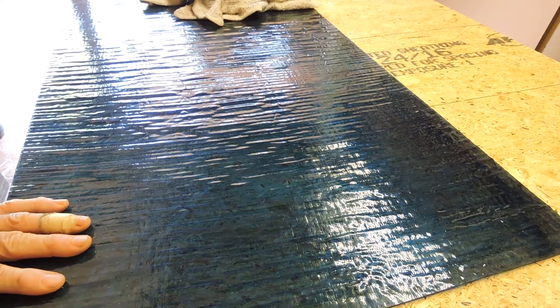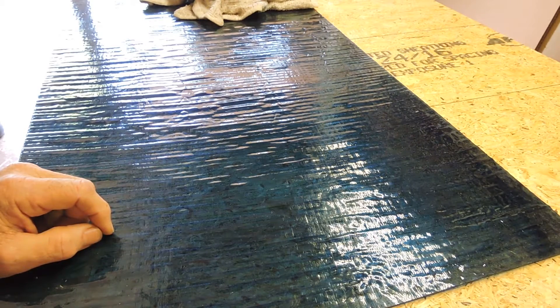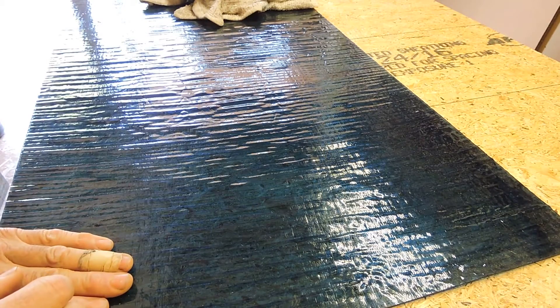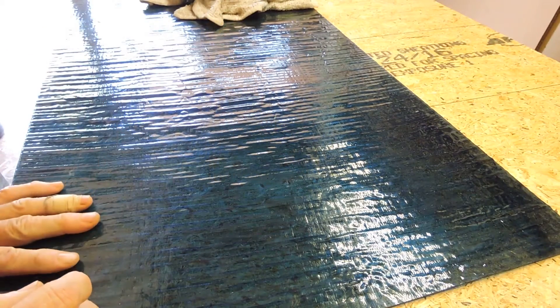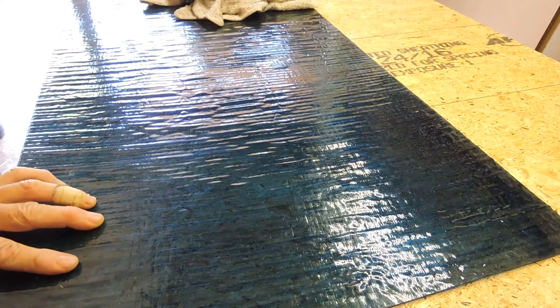We're going to talk about why it's important to discuss cutting this glass. A lot of people already know this, but some don't. I've seen some blogs and posts where people literally wash their glass — I'm fascinated by that. They're washing the glass because there's a residue on it, often not always. Some companies more than others, especially on clear textures and architectural clears — it's kind of like a fine talcum powder, almost like mini cornmeal. It keeps the glass from sliding across each other so it doesn't stick or scratch. Some residue may clog up your cutter or disrupt your cutting ability.